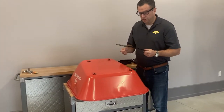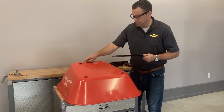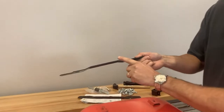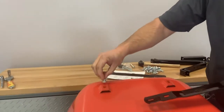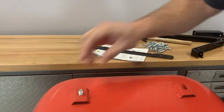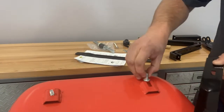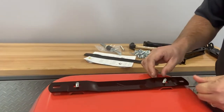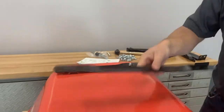The second step is we're going to attach the under tray braces, which is a unique feature to Erie. It gives the tray a lot of support to the bottom through these clips that make our tray seamless. This under tray brace has got an elevated portion — this is the Erie logo on it. You're going to take the short bolts that are supplied, slide them into that groove so they don't spin, then slide this other bolt in and put that on with the beveled edge down towards the tray. Do this on both the front, and also take the longer one and do it to the rear of the tray.